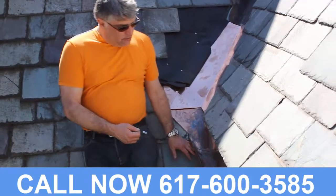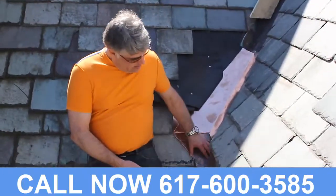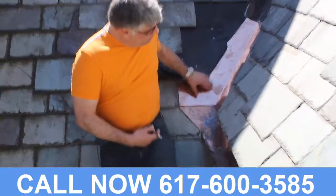So this gutter is cut back to the roof pitch. This dies into the roof — it's cut back to the roof pitch with a little space, and then that flange tucks right up underneath the valley.